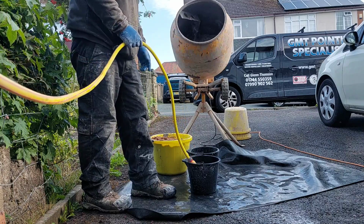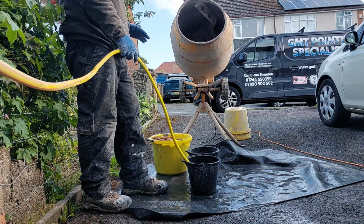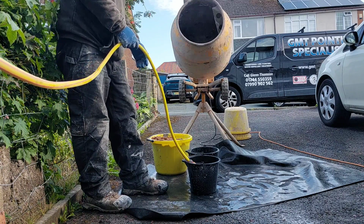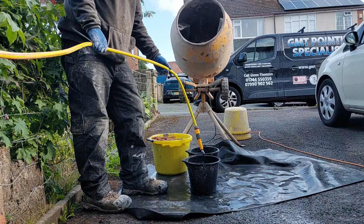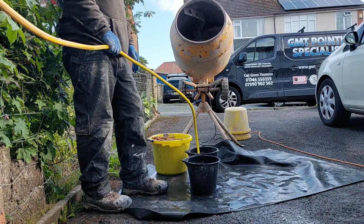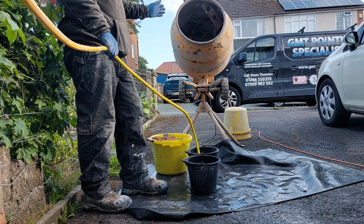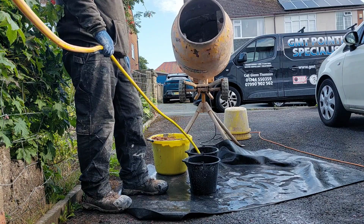So when mixing a hydrated lime mix with cement, you have your 5 sand, your 1 lime, hydrated lime, not hydraulic, hydrated, and then your water. Don't use any PVA, don't use any plasticizer, because the hydrated lime is a powdered plasticizer.